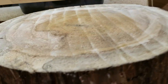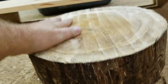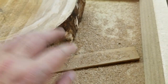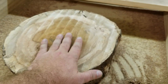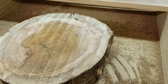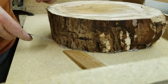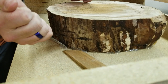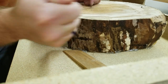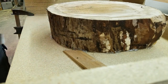The piece is fairly flat now — really good. It'll be sanded at the end, but right now I'm going to remove the glue, the shim, and all this stuff. I'll clean all this off, flip it over, do it again, then sand it and take a look at the whole thing. Use something like a chisel — something fairly sharp — to get in behind the glue and come under it. Once you can get a hold of it, pull it out.